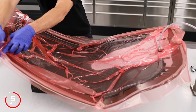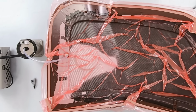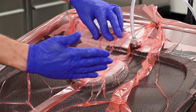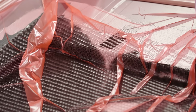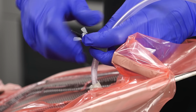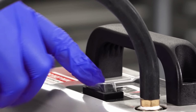As the infusion is reaching the resin break where we remove the mesh, you can now see how this works. Without the mesh, the resin flows so slowly that a drier area is maintained for a long time around the vacuum point. This allows time for any unevenness of the flow front to equalise before the vacuum connection is finally reached. The vacuum line should be firmly clamped once the infusion is complete and the resin can be seen in the hose. After this, the vacuum pump can now be switched off.